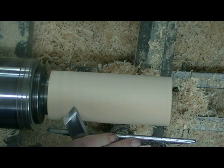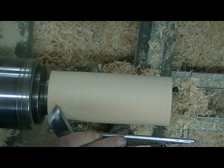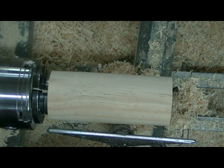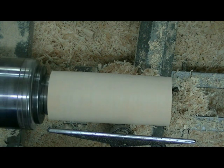And we just go back to take this edge out. Okay. Now people say rub the bevel, but it's not. It's caress the bevel or float the bevel. That's a Stuart Batty term, float. I must admit it sums it up pretty well, I think. Now if you press heavily on the bevel, this is the result and the noise that it makes.